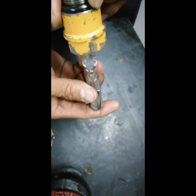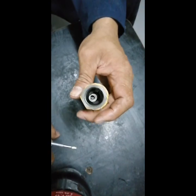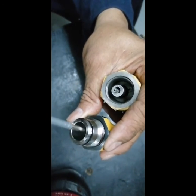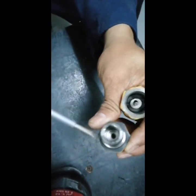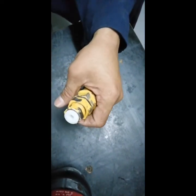There is a small spool with a small spring — I can push it and this side moves. The parts inside are okay; the only problem was the small cup that holds the needle. The small o-ring inside that cup was broken, meaning the pressure from the pilot supply was leaking out the side of the cup — uncontrolled pressure. That's the function of the relief valve — controlling that pressure.